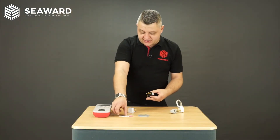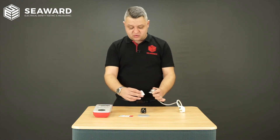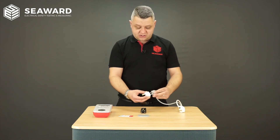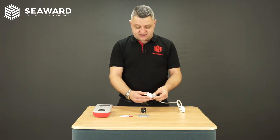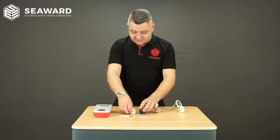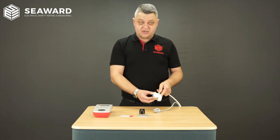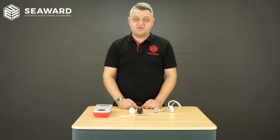Now these being multi-use adapters, they are designed to be used in a certain way, but what makes them more dangerous is that although I can plug in my European plug in the required format, it also enables plugging in a combination of other live-to-neutral and live-to-earth configurations, which again makes them very highly dangerous. Furthermore, if we look at a standard UK 13 amp plug, it enables the equipment to actually be plugged in upside down. So just a couple of examples there of some highly dangerous counterfeit electrical products.